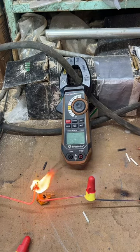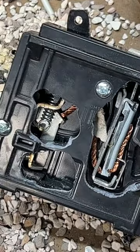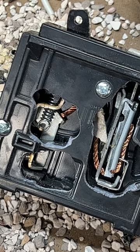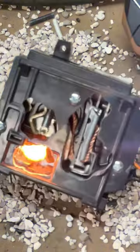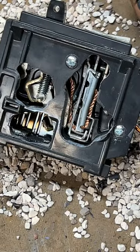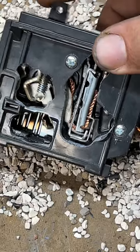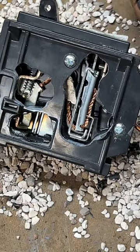This isn't a real-world test because we are getting failures at five to ten times the rated amperage. Next, we torture-tested a 20-amp breaker. This style of breaker has two ways of tripping: thermal and magnetic. A magnetic trip requires 10 times its rated value and is an instant trip. A thermal trip usually occurs somewhere between 1.25 and 10 times the rated value.